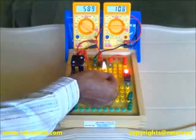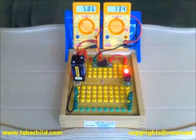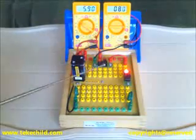While we heat the thermistor, we can watch the current through the LED increasing, because the thermistor resistance decreases. The current has increased and the brightness has also increased. Now the thermistor is cooling down — the resistance increases as the thermistor cools.